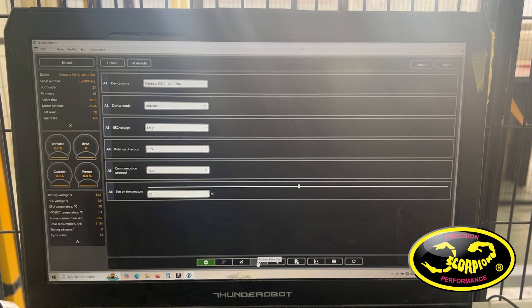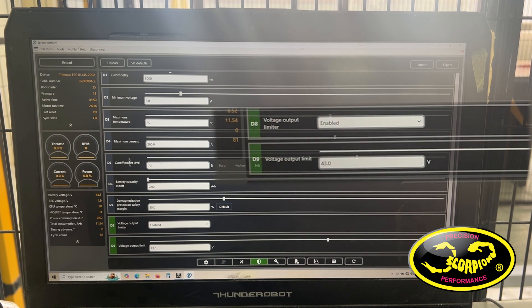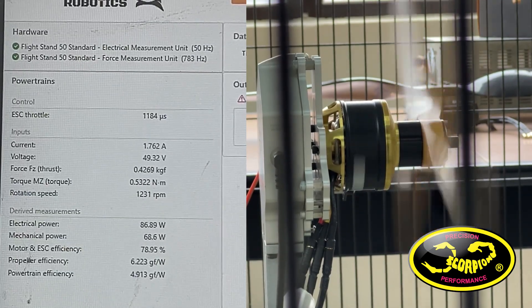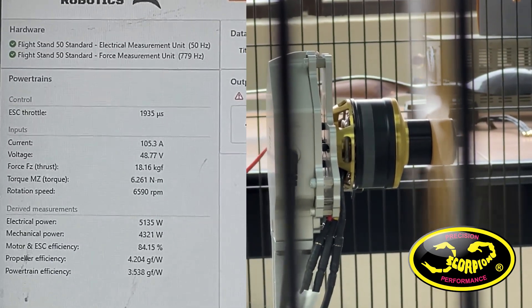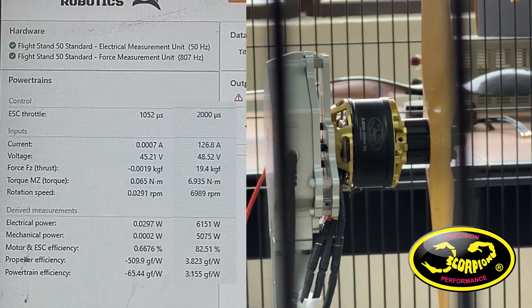So we have implemented a new adjustment: Value D8, voltage output limiter. As stock it is disabled, but you can enable it and set what is the maximum voltage output that the ESC will send to the motor. Here I have set 43V, so the ESC will only send 43V to the motor. Even if the battery is fully charged or at a higher voltage, the output will be fixed.